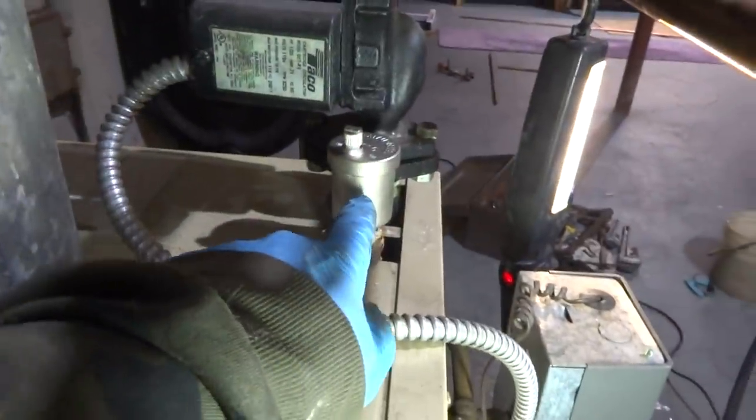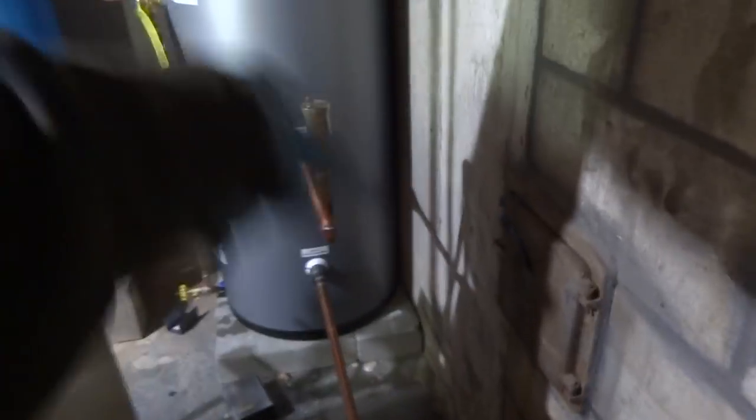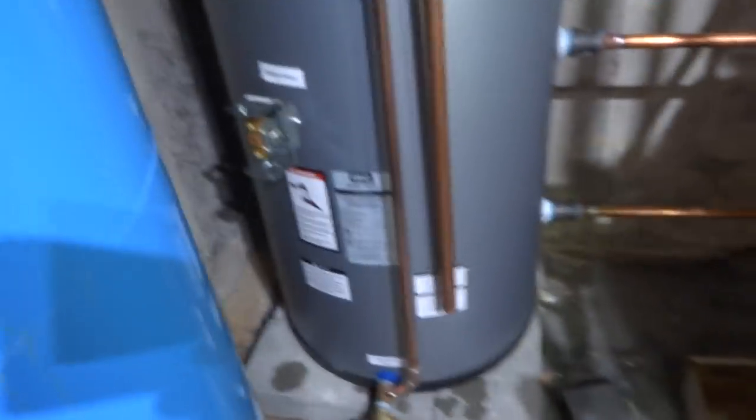Filling the boiler, we're going to check, see if I got any leaks. I did replace this high vent here, and I did put a high vent here too. I should be able to back feed that through that other one and purge it. Back feed it through this, and the air will come right out of that coil. There it is right there. I gotta put that drop on that piece yet, but I gotta do this wiring. I wanna make sure I got no leaks before I start attaching stuff to this pipe, you know?